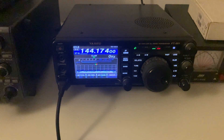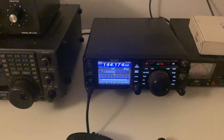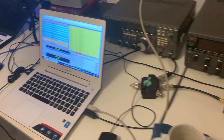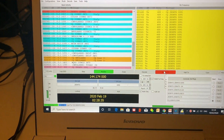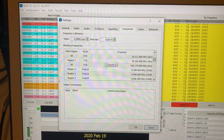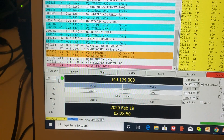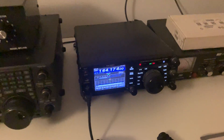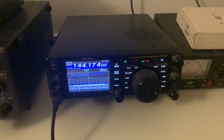I've operated FT8 on HF. However, on two metres my FT8 career is actually an hour old. For quite a while I've been meaning to set up two metres and see how far my signal can get on VHF. My version of WSJTX, which is version 2.1.2, didn't have the two metre frequency programmed into it already, but you can actually right-click the frequency table and add that information in yourself. When you do that, the two metre option appears on the panel. I did that, the CAT control took over, and the radio automatically tuned to 144.174 megahertz. The Yaesu has two antennas — one for HF and one for VHF/UHF — and away we go.